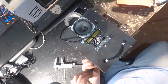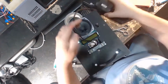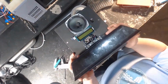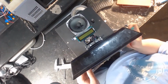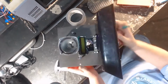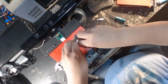And this is the Kinect. It's not quite as good as some of the cheap laser rangefinders you can find now on Amazon, but I've got one of these laying around. I got it on eBay for like $80, and it does give you a nice point cloud, so you can do ROS navigation with it. You still need the sonars because that Kinect is not good within a foot or two of the front of the thing. So when it gets close to a wall, it's like it's blind. So the sonars are still necessary for close-up obstacle detection, but the Kinect enables you to map a room in a way that is usable in ROS.